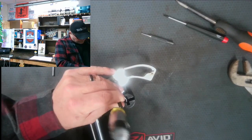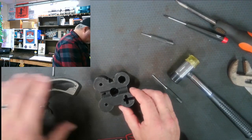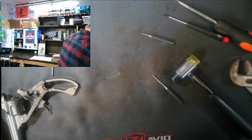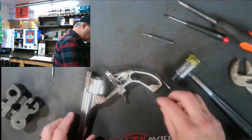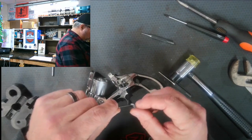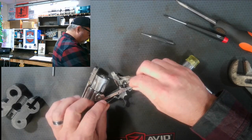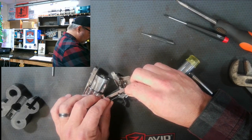I've got it started now — I felt it fall out the other side. There we go — there is the trigger pin. We'll put that over with our pin set. It happens to be exactly the same size as the rear sear pin — they're fairly interchangeable. The next piece is the cylinder stop, right here. You can see how it slides over the trigger, and the rear sear comes in from this direction and gets in behind the trigger — the two actually connect behind the trigger.